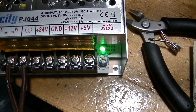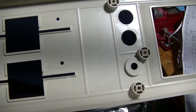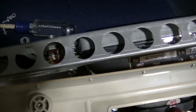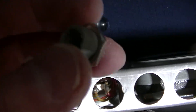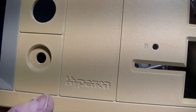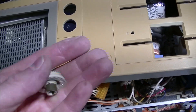With TTL it's got to be within 10%, so half a volt is fine. The screws in the corner should let me take the bezel off. There are seven screws holding this in place, but five of them were present and two of them were missing. The end of the switch over here was sort of crazy glued together, and not terribly well. Anyway, it's gone. I'm going to clean this up. The plastic has faded. I'm not going to retrobrite it — I guess it's an antique, so it will look like an antique. I will clean up the knobs as well.